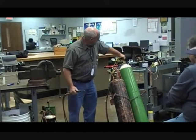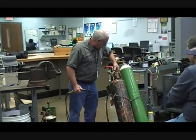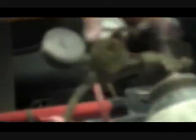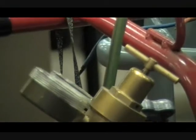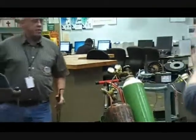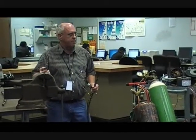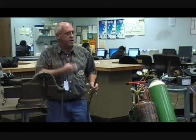I'm going to go ahead and crank up the valves and bring up the pressure on each. You don't want to put your head in front of that valve when you're adjusting it either — that's the dangerous part, directly in front of it. How many of you smoke? Take your lighters and leave them in the classroom when you're doing this. You've got a small explosive in your pocket. If you were to catch on fire — if you had a spark come down to your shirt, you could wind up in a fireball from something as small as a lighter.